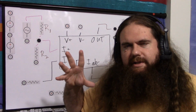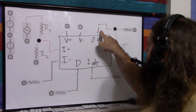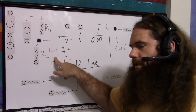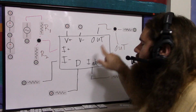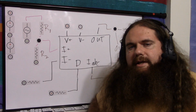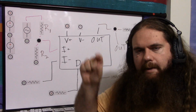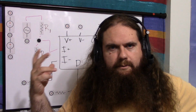The idea is to amplify the signal. You want a higher total voltage. So you have a certain resistance between output and circuit ground. The OTA is going to put out a certain current. What is that current? You have your input differential voltage times your transconductance equals your current output. What is transconductance? Once again, it's just on your data sheet. It's amps per volts. It's units of Siemens, which is amps per volt. So you get input volts, output current. So amps per volts times volts equals amps. Voltage in times transconductance equals current out.